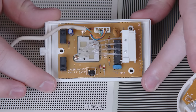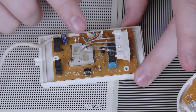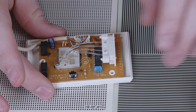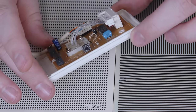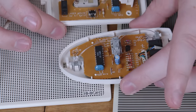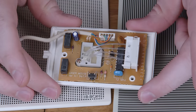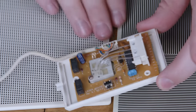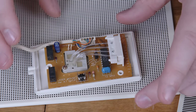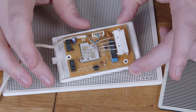So about that — why are there so many more strands here? The LMOX2 has a total of 16 fiber strands, which is four times what the Q500 has. This was obviously what caught my eye, and at first it just looked like total chaos. My initial response was to assume that these two designs had nothing in common. However, after studying this one for a while, I think they aren't as different as they first appear. I think the alterations on display here are very little more than what was needed to allow the mouse to distinguish X from Y movement on the same grid. Other than that, I don't think the mechanism is that different.